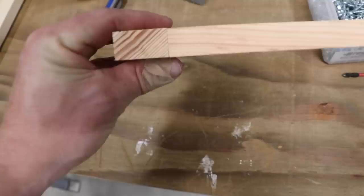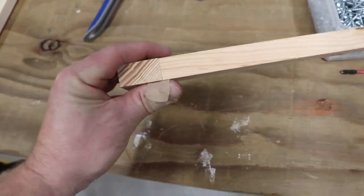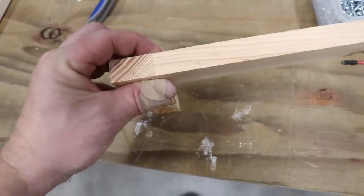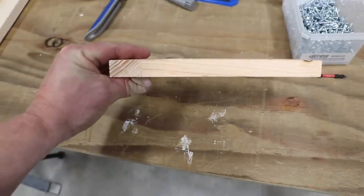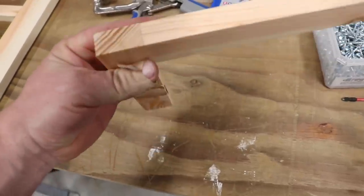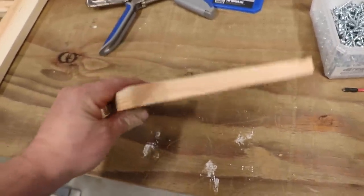I don't feel like this joint is that spectacular. It feels like this is kind of tilting. I can't tell you if that's because of the screw or the wood. It kind of looks like it's the wood. That joint looks fairly tight, if you will, but I think that it might not be square. And so the net result, I'm sure you guys can see it on the camera, it looks like this board is kind of going up ever so slightly. So not beautiful. Probably a consequence of this face not being square to this face or something like that.